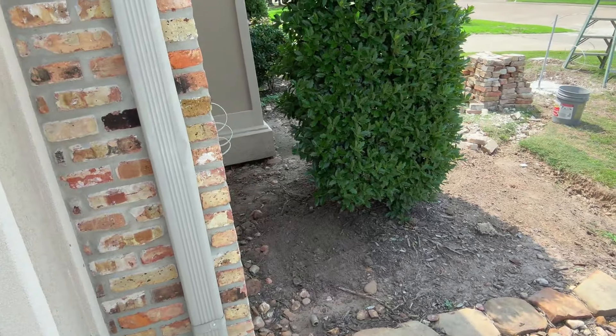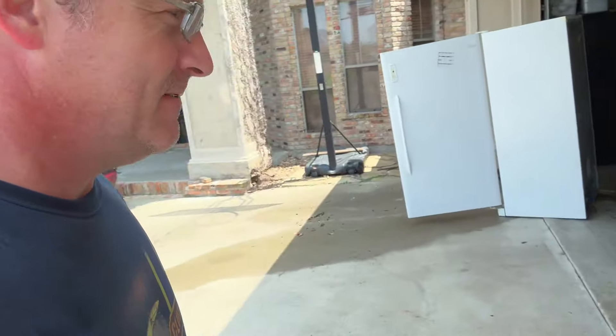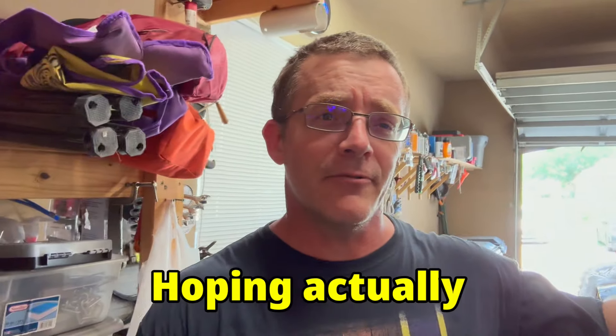I also got the big project that I've been putting off forever because I knew this was gonna happen. That escalated quickly. That was my light pole there. Tore the whole brick column apart because the wire that I needed to replace was grouted in through every layer of brick. I was thinking maybe take a layer or two off and there'd be a hollow void in there somehow — kind of how I would have built it, to save on brick and give it a place to run wire. Anyway, the wire was grouted in through ten layers of brick, so there was no pulling it out. It had to be replaced unless you ran a wire on the outside, which would look like crap.